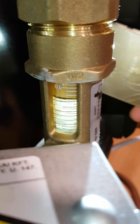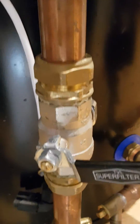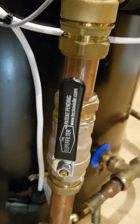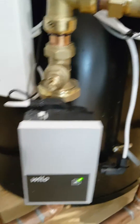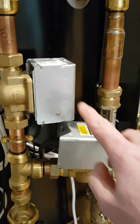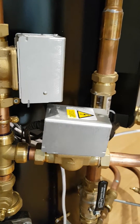If you have low flow, you need to look at a few things. First, check that your filter ball valve is fully open. Check that it's clean by removing the cap at the back and cleaning the gauze. Check your pumps are running flat out, and that all valves — your pump valves, heating valves, and hot water valves — are also open.